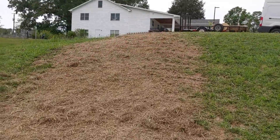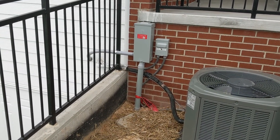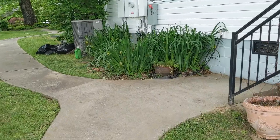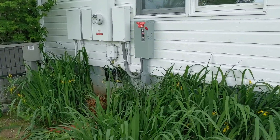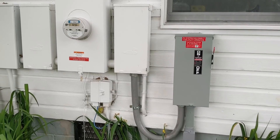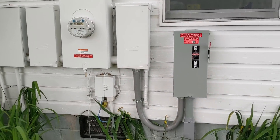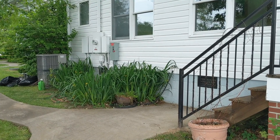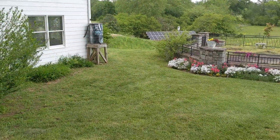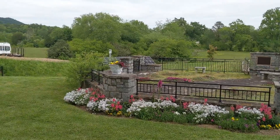Strawed and seeded — ready to go. We made our transition with a breaker disconnect, followed the HVAC lines in, and brought it over to the meter base through the crawl space. Here's the disconnect we added — they'll probably end up painting it to blend in. All labeled up and ready for inspection. We added our fuse disconnect with a line-side tap, and it's ready to go. The system is built with 100-amp capacity overkill — we're probably only going to be making 40–44 amps max with this array.